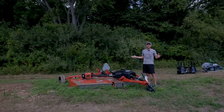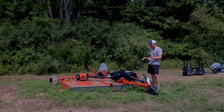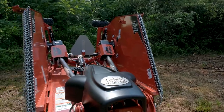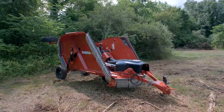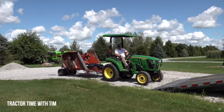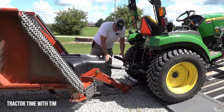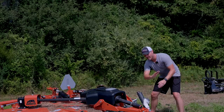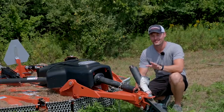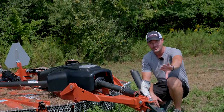This next one I had nothing to do with, but I own the equipment. Tracer Time with Tim had a major snafu with his Rhino TS-10 — something to do with the instructions. He didn't have minimum clearance between the gearbox on the cutter and the gearbox on his 2038. It's one of those things you don't give a lot of thought to until it's too late. He was loading onto his trailer, and when everything's flat no problem, but as you start to pitch up going up the ramp, you're shortening the angle — the PTO shaft is above the pivot point, so the effective shaft length shortens. At some point the shaft can't get any shorter, and something had to give: that was the guts on the backside of his tractor. He didn't even realize it right away and went ahead mowing for a while before it became a problem.